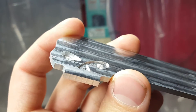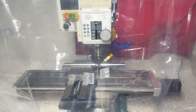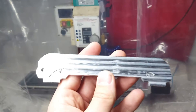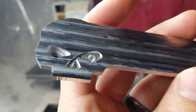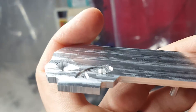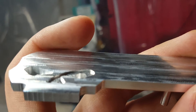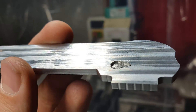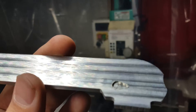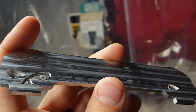I'm tired of breaking 1/32-inch end mills — I think I broke four or five of them. I was using four-flute end mills, which was my mistake, because without coolant they were gunking up and snapping. I tried full depth of cut and it broke, then I cut the code to a quarter depth of cut, got one eye done, got partway through the next, and it snapped again. Same thing on the retry — got a little further and snapped.